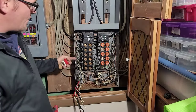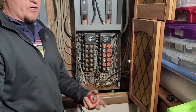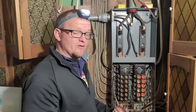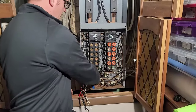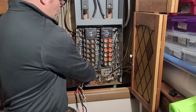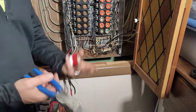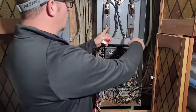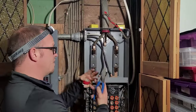That way, if I need to match that wire up later for overcurrent — for the fuse or breaker I'm going to be putting it on — it's helpful to know what wire came from where. So I'll literally just snip all these, and sometimes I'll go down to the neutral bar and ground bar and snip all those, though sometimes it's easier just to back them out by hand. Now I completely unhook all the wires, unhook the mains, and get them all disconnected.